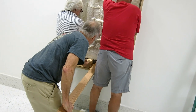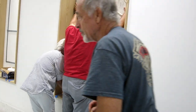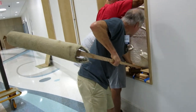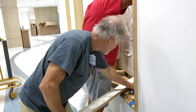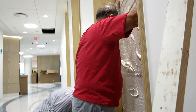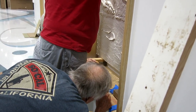The plan was to use a battery drill to raise and lower the jack, but it wouldn't fit — there wasn't physically enough room. We didn't bring a ratchet, and the jack was too hard to turn by hand when in the lowered position. So we used the teeter-totter board — I gently pushed up on it while somebody took the slack out of the jack by hand. Once it got up a couple inches the scissor jack has better mechanical advantage when the scissor part is taller, and then we could turn it by hand. On the second two reliefs I brought a ratchet, which solved that problem.